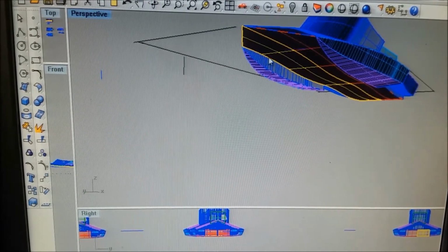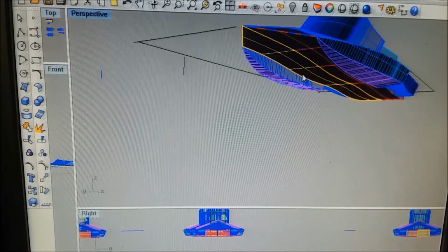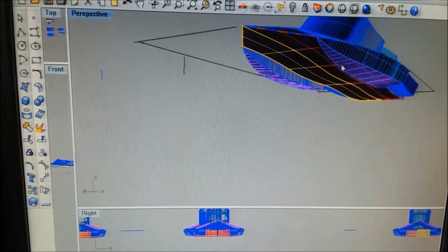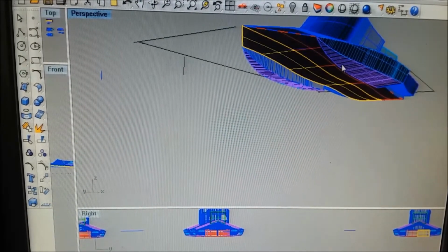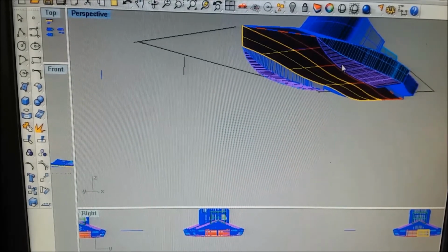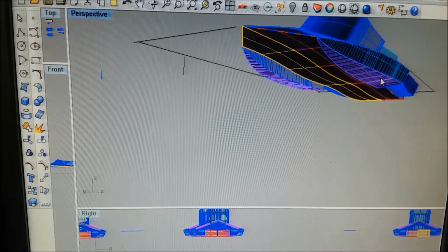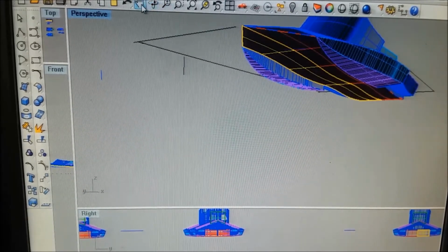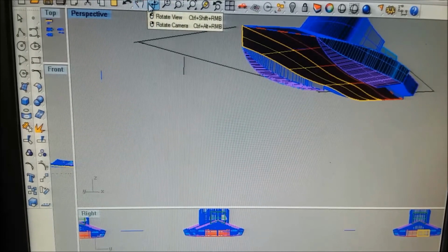And you basically just walk down all the seams, putting tacks. This is just like a stitch and glue boat. Then you can come back and weld the back side, and then come back and weld the front side. But the trick to these things is making all these shapes that are curved edges when they're laying flat. When it's a piece of metal laying on a workbench and you want to cut this shape, that's the whole trick to this computer-aided design; it does that very well.